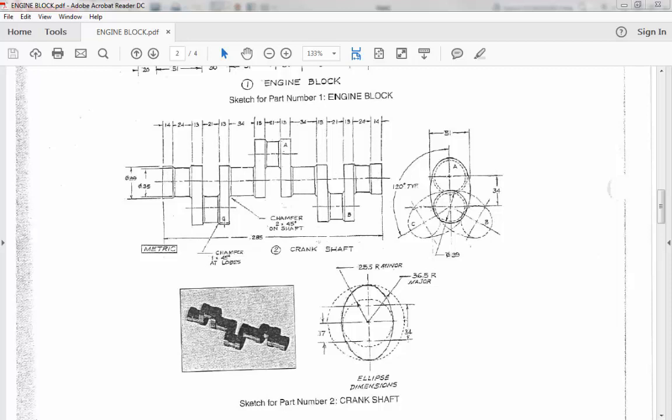Now on these other ones we have 35s as well. On A, this inside one is 35, but it doesn't have a 2 by 45. It has a 1 by 45. This has 2 by 45, but this has a 1 by 45. So it has a smaller chamfer, which means it doesn't go out quite as far. It's going to have a 35, but it's only going to go out 1 on both sides, which gives me what size circle for the outside one? I'm adding 1 on both sides, so that gives me 37. On A, B, and C, I've got a 35 and 37. The ones right down the middle, I've got 35 and 39. That's important to note.